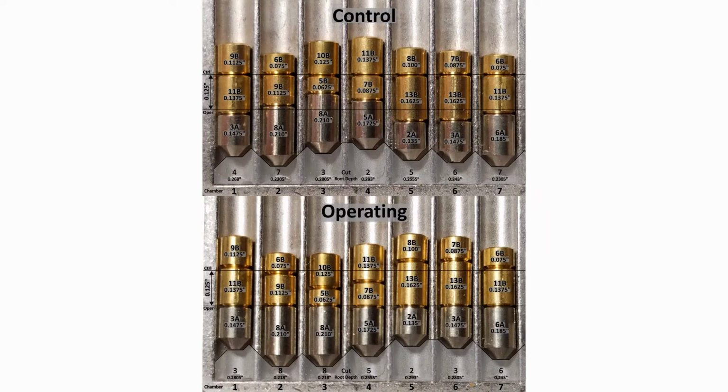So now let's consider picking this lock. We're going to look at chamber number 1 here. We put them both together. It may be difficult to see the graphics, but that doesn't matter. What we're concentrating on is that we're going to lift the front pin, which in this case is called chamber 7, because that's the way they're numbered, from the tip of the key to the bow. So we lift this pin up.